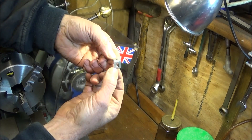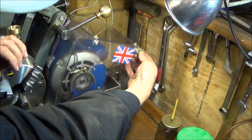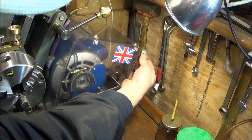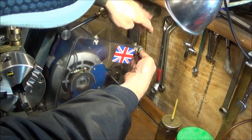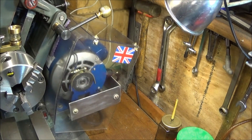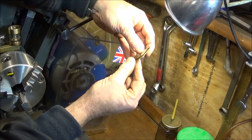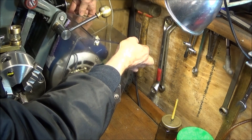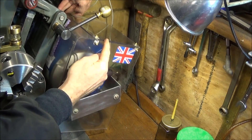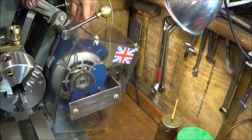To fit the top I used a couple of small aluminium right-angled brackets, mounted on the inside. These have a bit of a slot in them so I can move them up and down — I moved them up so they were level, and the top piece comes down on top of those nicely. I then used 4BA screws, drilled for those, and bolted it all together. I also made a fold-over brass clip that slides onto the top, over both the front piece and the top piece at the back, and that holds the two firmly together.